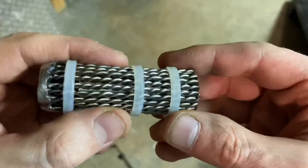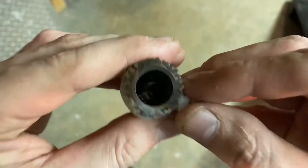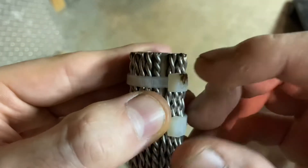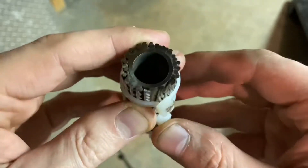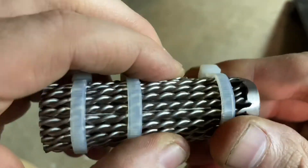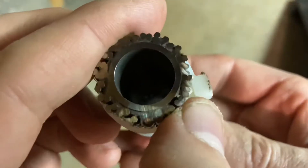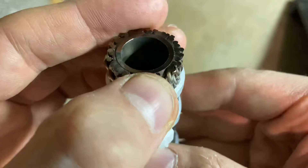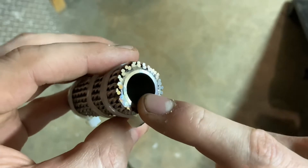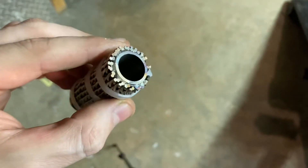Ended up chopping it down on the chop saw. Added a three-quarter 065 sanitary pipe on the inside. Right now I'm just going to fuse the top half, and I added in another curled up piece of TIG wire to fill in a little gap. I'm going to buff it down afterwards so everything's nice and even. Now that I have some backing I'll be able to weld to the pipe and everything will be nice and sturdy. We're going to figure out what this thread size has to be and start building our cap here pretty soon.